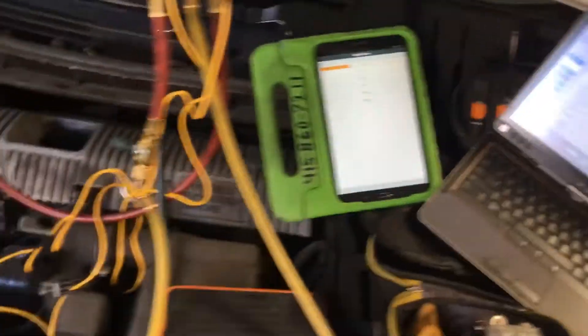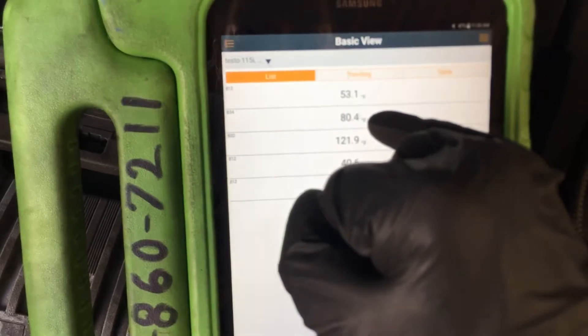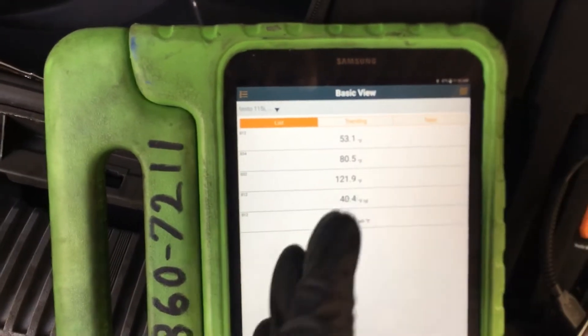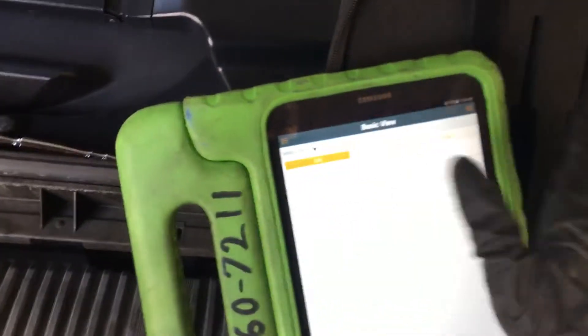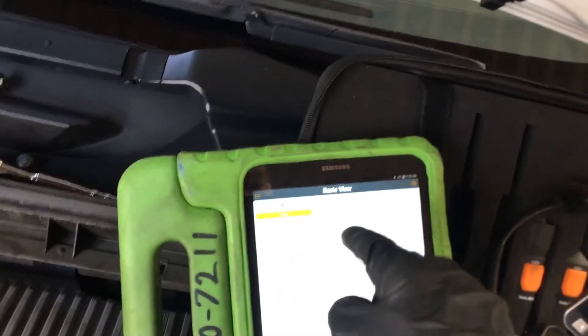You've got a cool car because you charged it right and didn't use those little jerk-off cans and just topped it off, because every Prius when you're done with it that way is always cold. Our inlet temperature to the condenser is 121°F, our outlet temperature of the condenser on the liquid line is 80°F, and our cabin air temperature at the headrest — right where your face would be — is 53°F inside. The air vents are directed away from the driver; I have them pointed toward the far corners and window. We're at max cold.